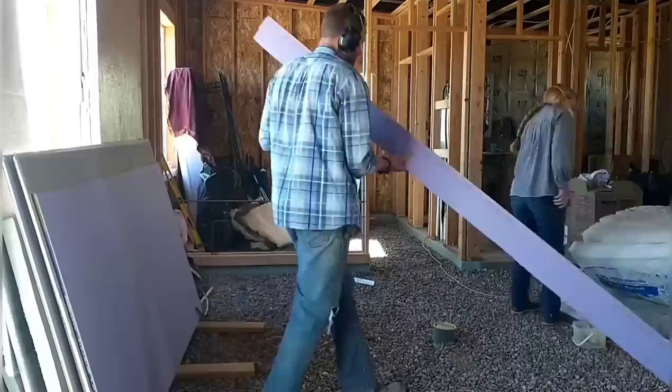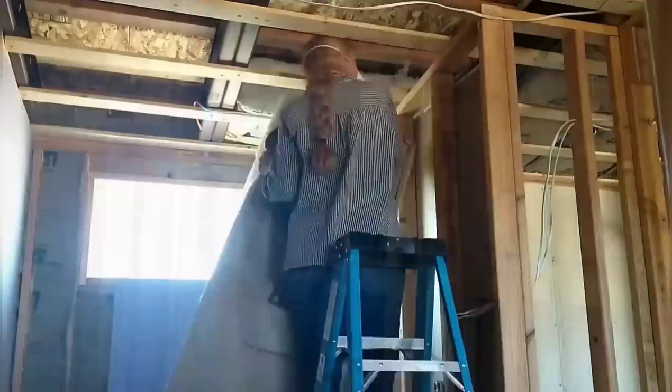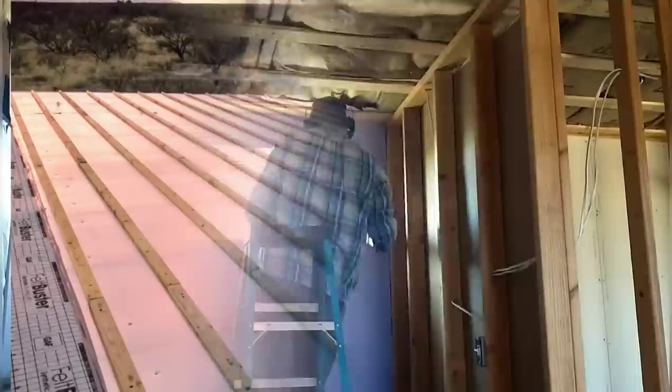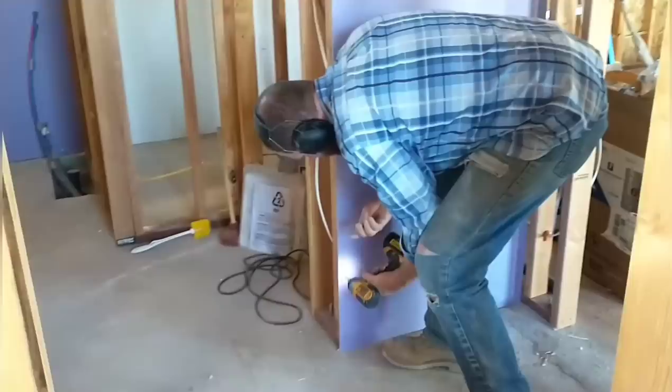As mentioned in our last video, we've been working on drywall in conjunction with the poured concrete walls. We decided to start in the guest bathroom and the pantry — that corner of the house. April is focusing on insulation, which is a huge help, and I do the drywall behind her. The insulation we're putting in is 10-inch thick batting with an R-value of 30. Combined with the foam already on the roof, we'll have about R-40 in the roof — not tremendous, but with no thermal bridging it's a really well-built roof. The thick batts are a little difficult to get between the beams, but fortunately they come in four-foot-wide batts that fit the four-foot beam centers.